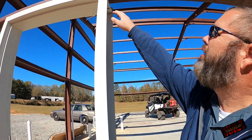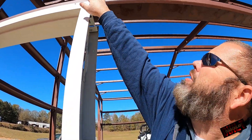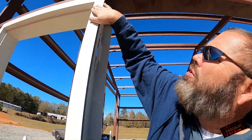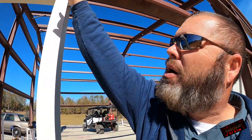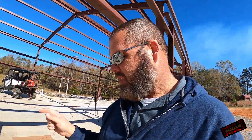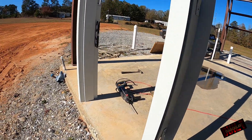Put the door together and get it up in here. This part always goes on the top side, on the outside — the tin kind of goes over the top of it. I'm going to put J-trim all the way around to make it look nice. I'm not sure if my kit has J-trim yet, I haven't gotten into that box, but that's what I'm going to do. First step: drill your anchors.